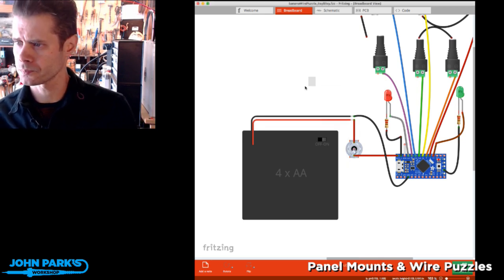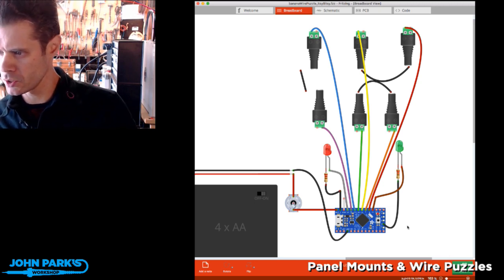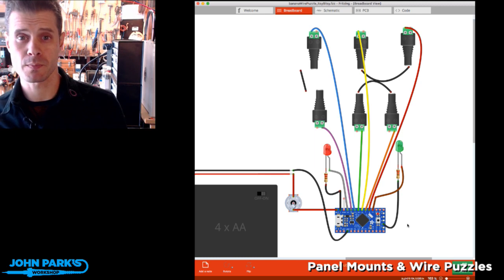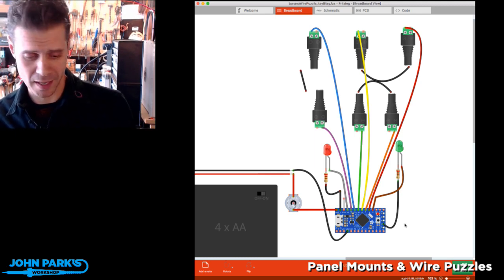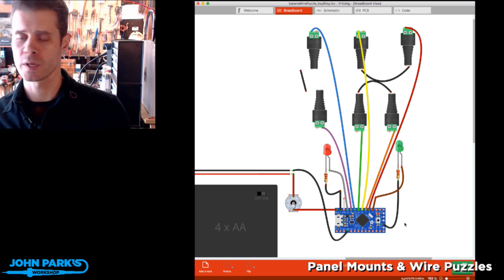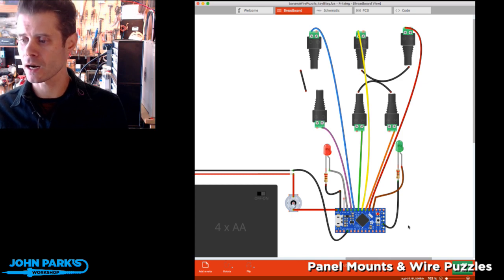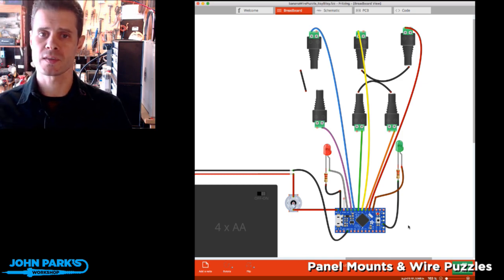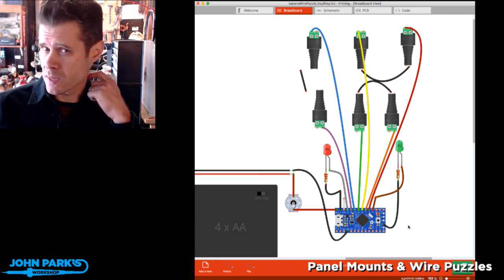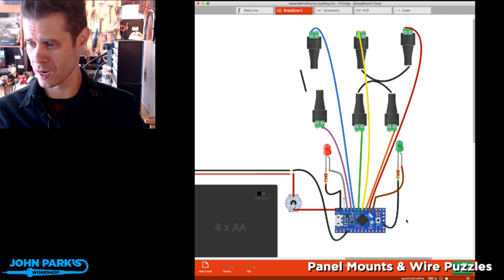So here's what we're building. This is a 5-volt Itsy Bitsy microcontroller, which is a new kind of replacement, really, for the Trinket Pro. This is the first project I'm starting to do with it. I was just playing around with it a bit last night, and it's pretty cool. It's the same 32U4 chip that's on an Arduino Leonardo or the Adafruit Metro, so it has the same number of pins. It's basically identical, just super tiny. There are some differences, but functionally speaking, you get the same pin mappings, so your code ports exactly between those. And of course it has the cool HID USB stuff that all the 32U4s do, so it'd be good for MIDI projects, good for USB projects. But I thought this would be a really neat one for this. It's like $10, a super cheap little microcontroller.